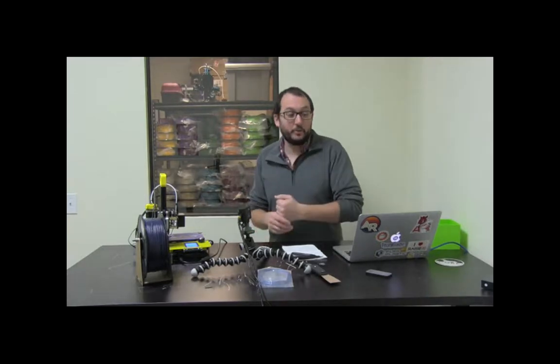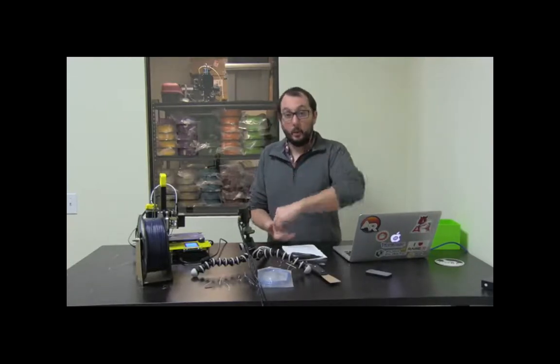But you can also do what's called a soft pull. Every time you unload the filament, if it's heated up to just 100 degrees, you'll soft pull the filament out of it. And that is when it's in a semi-solid state. It's like changing the oil in a car. It'll pull the gunk and stuff out of that nozzle and can help prevent clogs. And you can do that in your other 3D printers as well. Like when they're not fully heated, pull the filament out, because that'll clear the clog and clear out gunk that can be inside of it to help you clear it through.